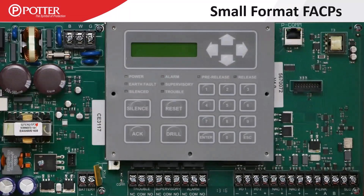Here's a look at the small format control panel. In the bottom left are battery charging terminals, moving right are our alarm, trouble, and supervisory status relays. Going across: two IO circuits, two NAC circuits, and only one P-Link circuit as opposed to two on the large format panel, then finally the SLC. It's worth pointing out that IO circuits can only ever be class B — they cannot be made class A on those small format control panels. We currently have a 2x16 display, but that is getting ready to change — a 4x20 display is coming in the relatively near future.